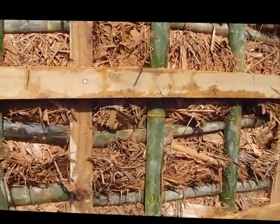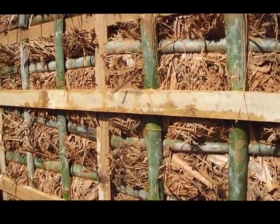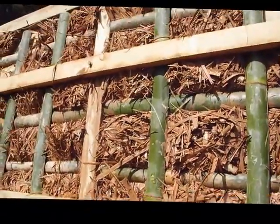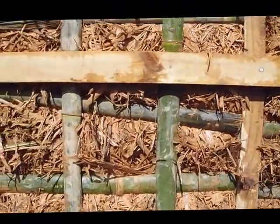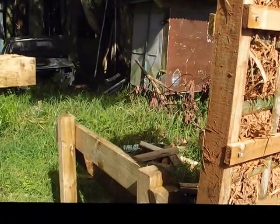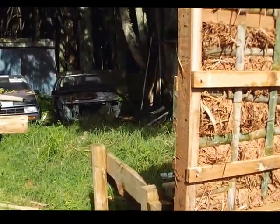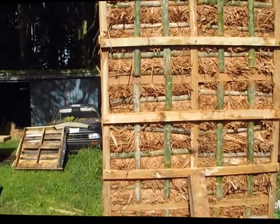Not that a bit of stuff poking out is a problem, because when we put our next coat on, our brown coat, which is going to be a fibre clay mix, that'll tuck all this in, fill in any holes, and really, I mean, it's looking pretty damn good. And I've just got this set up at the back here. I'll have to very securely nail this onto that, so that it doesn't go anywhere. Don't want it to fall on anyone's head.